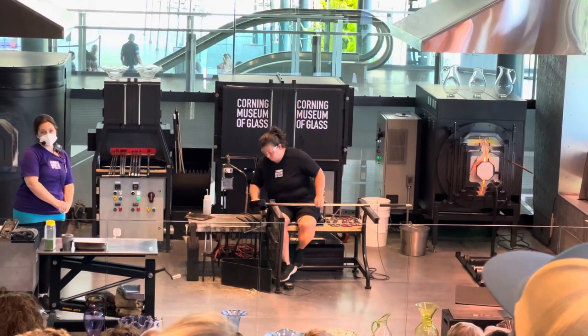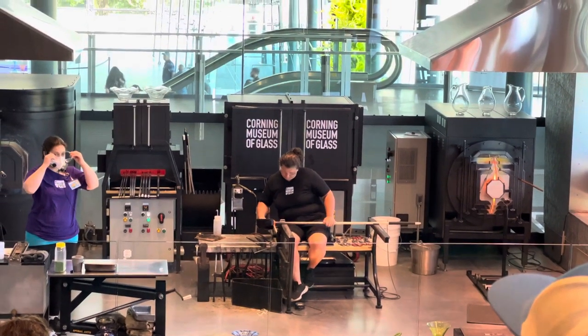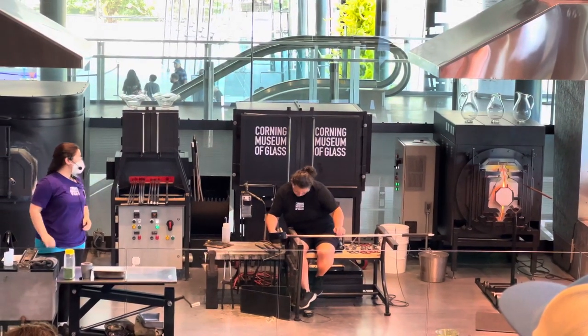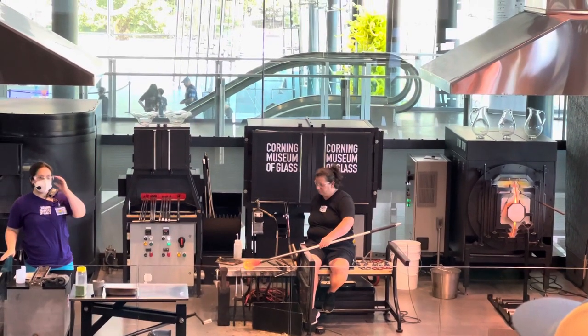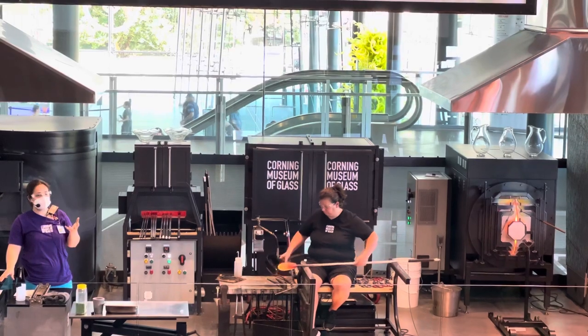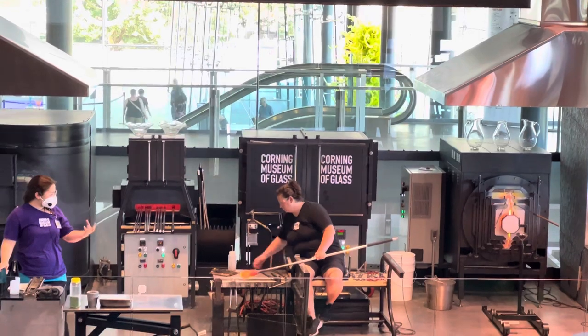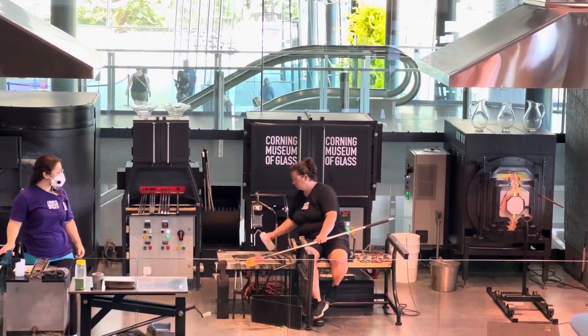Every tool Catherine touches to the surface of the glass is going to cool it down. We control the glass by controlling the temperature — the fluidity of the glass is determined by that temperature. If we raise the temperature over 2,100 degrees Fahrenheit, it moves more like olive oil. As the temperature lowers, it sets up and becomes rigid.